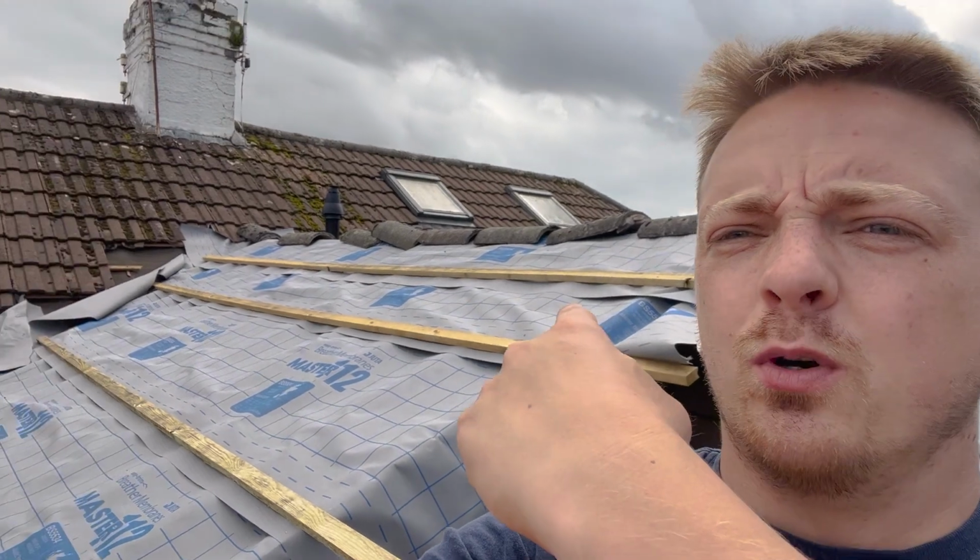Hi guys, welcome back to another video. In the last video you would have seen us putting the new rafters and the felt and batten temporary. In today's video I'm going to lift some of the roof up, start putting the furring pieces into the existing roof and the same into the bottom of this roof, and I'm going to try and work my way through and get all the furring pieces done and finished.